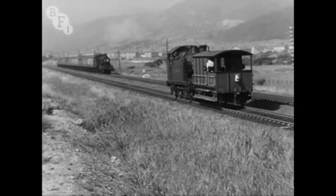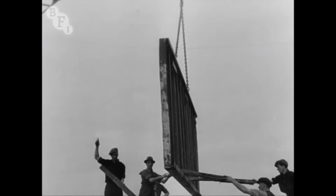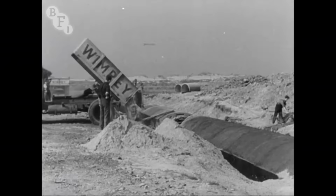The Abbey site again in August 1947. The first railway siding was coming off the GWR track. Work on the culverts had to be speeded up. Here shuttering is being lowered into place ready for the concrete, because across the culverts the temporary railway track was due to run. Once the culvert had been fully concreted, it was covered in with sand.